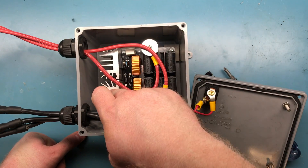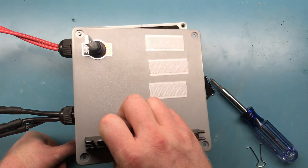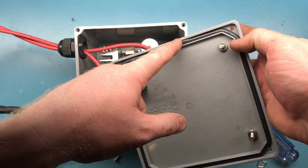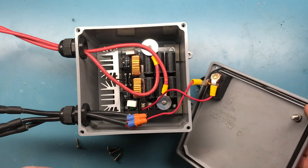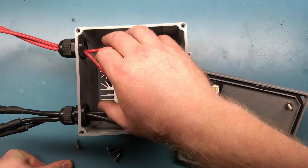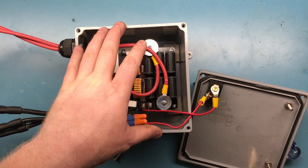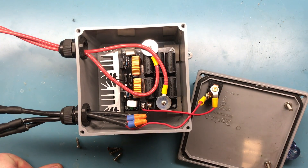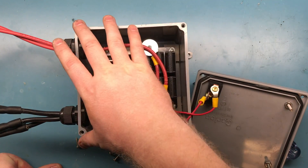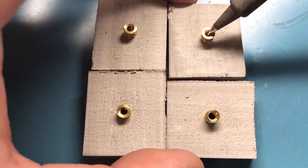This stuff is a little warm but not too bad. If you wanted to make this more robust, since these enclosures are designed to be waterproof and oil-proof, you could fill it up with mineral oil or silicone oil — that would really help with cooling. That's another reason you wouldn't want to use this all day: there's no airflow because this is completely sealed.